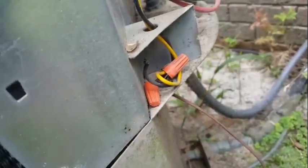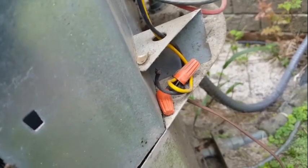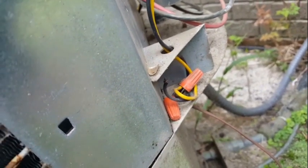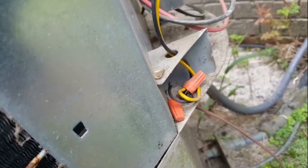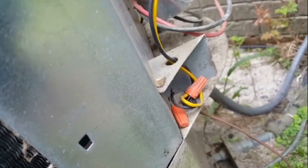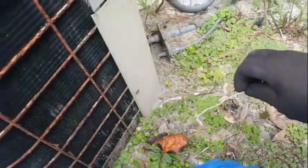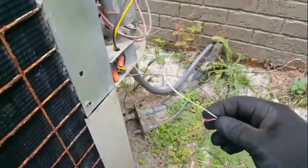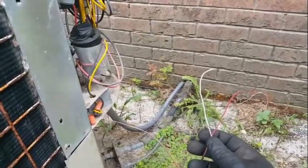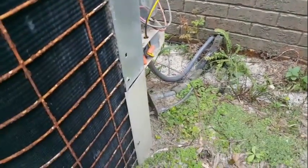I think there might be some smart asses here because there's another loose wire right there. You've got to be kidding me. That is amazing. So there's a loose wire, which might be the cause of why this thing is not running. The machine has voltage, and we have this connection here. So I'm gonna shut the power off inside before we blow the transformer and see if I can't find that wire and reconnect it.